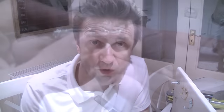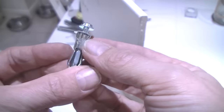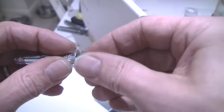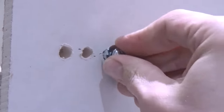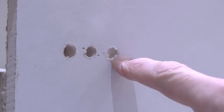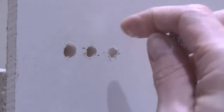I'm only telling you this because you don't want to drill too wide a hole. The reason for that is the fixing is designed with these little claws on the back, and when you're not using the setting tool you need these claws to anchor into the plasterboard to keep the fixing in place while you turn the screw. You can see the little claw marks appear really close to the edge of the hole, so you want to drill that hole as narrow as you can — no wider than it needs to be so the claws properly dig into the plasterboard.